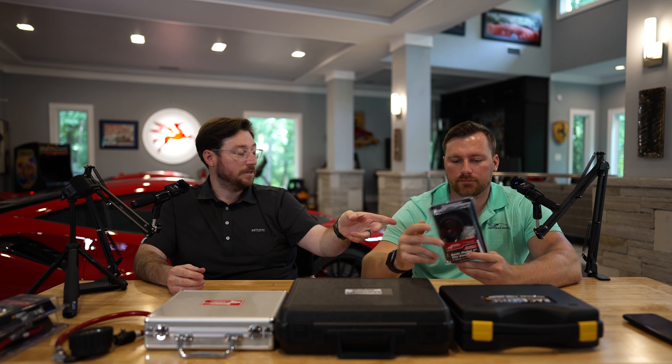Let's go through pros and cons. The biggest pro for the tried-and-true two-and-a-half-inch analog gauge: there's no battery, and it's easy to read. Some of these have a valve on top to clear pressure, giving a more accurate reading. These can also be recalibrated, as can the digital ones — just like a torque wrench, you should get them recalibrated every few years after dropping them or heavy use.